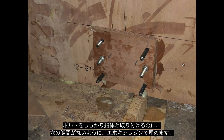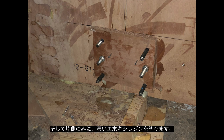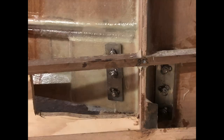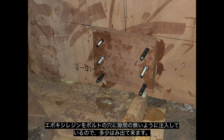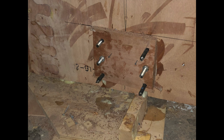To glue the bolts in place, using a syringe I was able to fill the holes with plain epoxy resin just to seal them up, and then I was able to push the bolts in. From one side only, I forced thickened epoxy resin through using the syringe, so it oozed out the back and the bolt was completely encapsulated in the thickened epoxy resin. Once I could see the resin oozing out the back of the hole, I brought the metal plates and screwed the threaded rod into them, holding those bolts nice and secure.